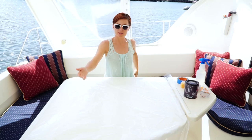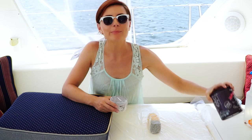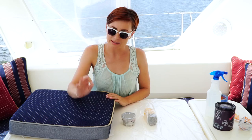Chalk paint is supposed to be amazing all-purpose stuff where you don't have to prime anything — as long as it's clean you're good to go. With the paint, I don't want to use it full strength. Everybody said water it down. Some people said spray your fabric and water down your paint. I tried that on my test strip and I thought it was too much water. I've gone with about a three-to-one ratio — three parts paint to one part water — and I'm sponging it on. It worked out well for my test strip, so that's what I'm going to continue with.